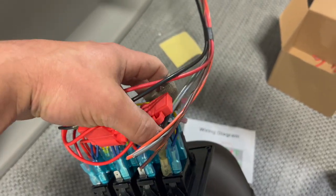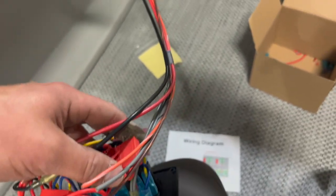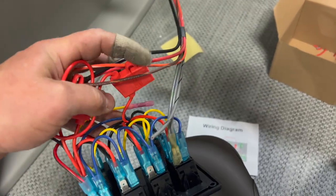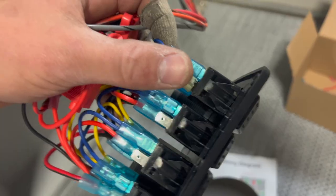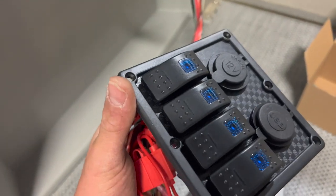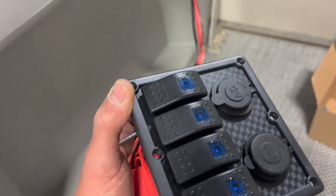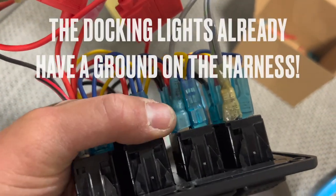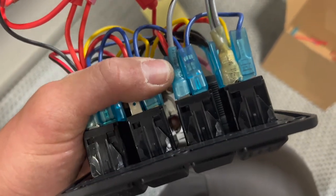We have a brown with an orange stripe that's a live well pump or an accessory of any sort, and a black with gray that's actually docking lights or headlights for the boat — our navigation lights. What we did on this: because there's not a full navigation switch that gives you front bow lights with your anchor light and then anchor only, I put them together into a female connector and that is powered by the first switch. So that'll turn on our bow lights and anchor lights all at the same time. They're LED so it's not going to put a huge drain on the system if you left them on. I also ran the docking lights or headlights in so it's ready to go if he wants to add that — just cap off the docking lights up front and leave them accessible for future use.